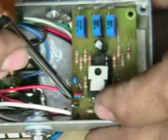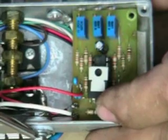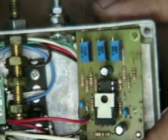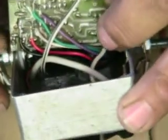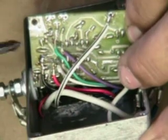The terminals on the regulator zero board — power in comes from here. This is your key power, solenoid power to power up this unit, your negative and positive. This would be the cell in right here, and this would be the grounding of the cell out. Here are my connections — I leave the wires long enough that I can get in here and do this.